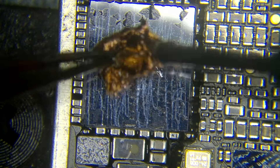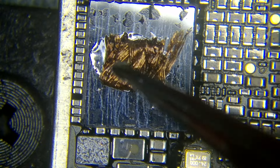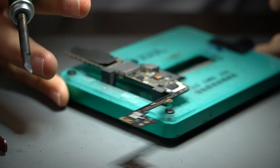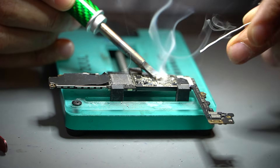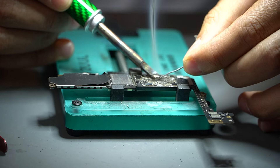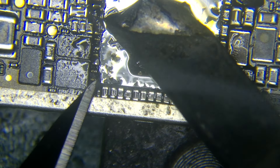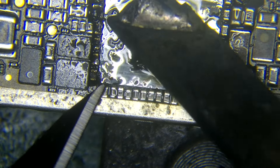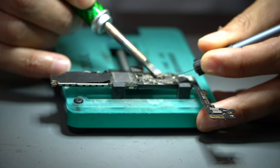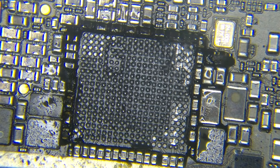Some flux like that. Then I'm going to bring my iron and prepare to remove this from here. This one is at 450. I'm going to apply some solder and bring my bisturi — my blade — at the corner. We just have to wait a little bit, and there you go. See? Without any risk.